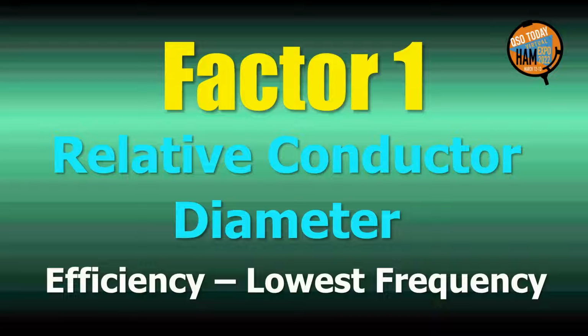Conductor loss also sets the lowest frequency usable for a mag loop. Yes, even though many websites don't mention it, and sometimes even provide oversized tuning capacitors to let you tune below the limit, mag loops have a low frequency limit, and this limit is determined by the diameter of the loop's conductors. If the loop's conductors are too small, as they are on many loops, the loop has a very limited low frequency limit.